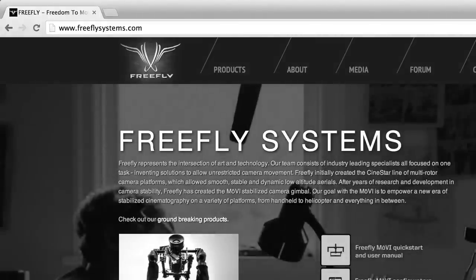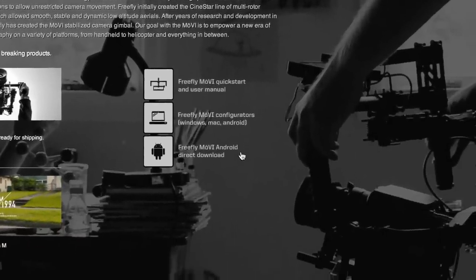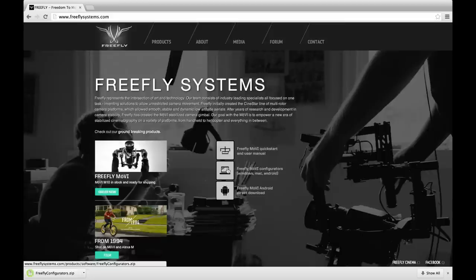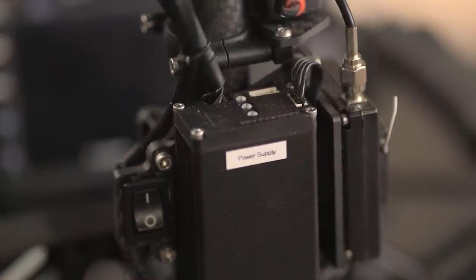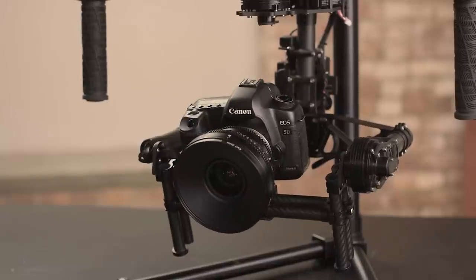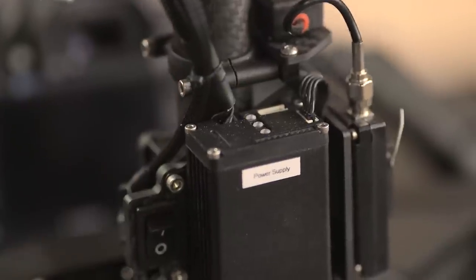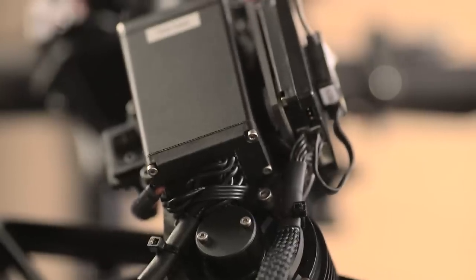Once you've balanced the Mobi, you can move on to calibration. You'll need to download the calibration software from FreeFlySystems.com. The software is available for Android phones and tablets, Mac and PC computers. Bluetooth is required to communicate with the Mobi. With the PC version, you can save calibration, so keep that in mind when choosing your field kit. Make sure the Mobi is unencumbered on the stand and not moving when you power it up. The three lights should rapidly flash, then go solid — during this, the gimbal will automatically acclimate. If the lights continue flashing, power it off and repeat. If this persists, one of the connections is likely broken, usually the result of a connector coming loose. Check the connections on the electronics and motors.